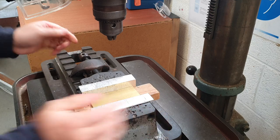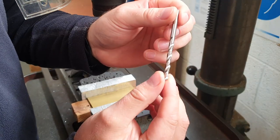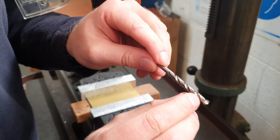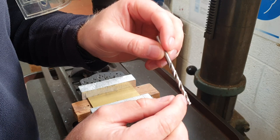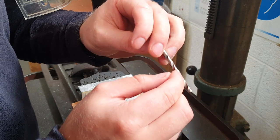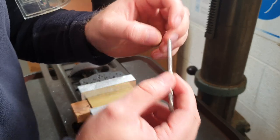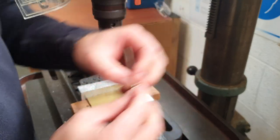The next thing is to set up the drill bit in the chuck. Our drill bits look like this — as I'm sure most of you are familiar with — and these little grooves going up the drill bit are what we call flutes. The flutes are where the material clears out when you drill, working its way up through the helical spiral and all the way out. When we're clamping the drill bit, we must clamp it on the flat part here, and not down on the flutes.